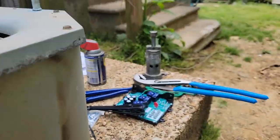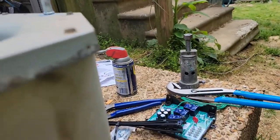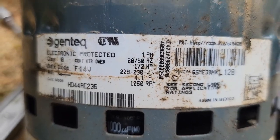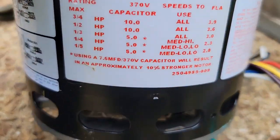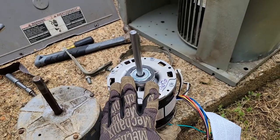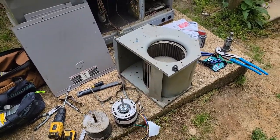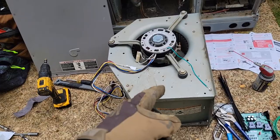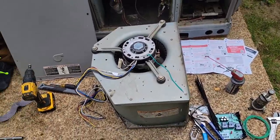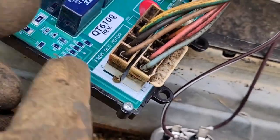The old motor has been removed. I had to use my bearing puller — make sure you have a bearing puller, WD-40, and sandpaper. This is the old motor. I checked the horsepower: half horsepower. I have a universal motor. Make sure you know what capacitor you'll use — 10 microfarad. If you want to learn more about motors, I've got a video in the link in the description. Now I'm going to get the new PSC motor installed in the blower housing.